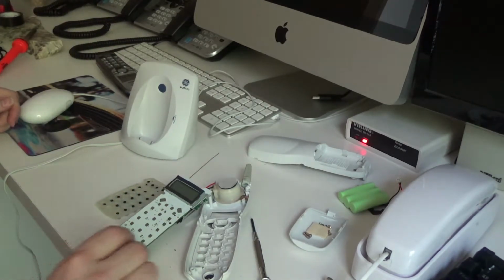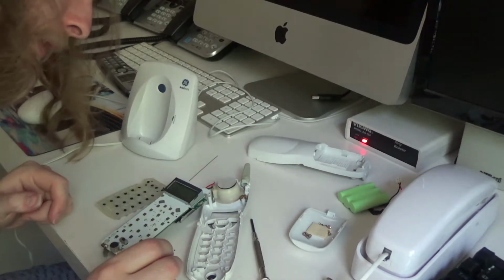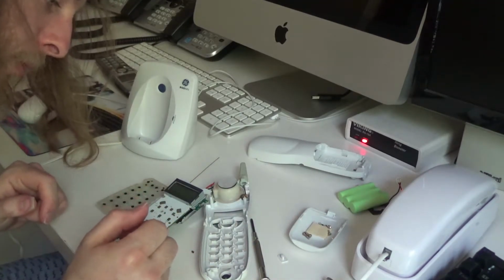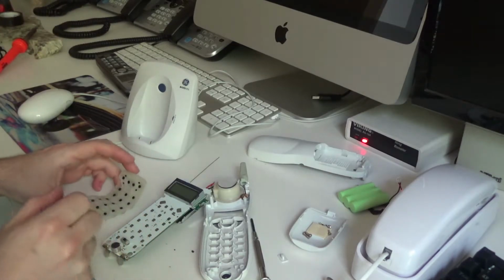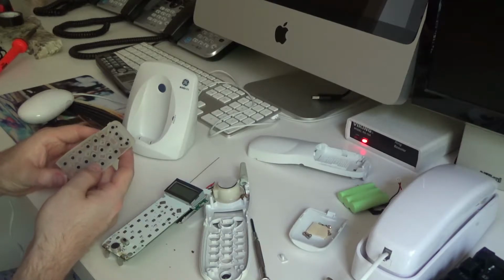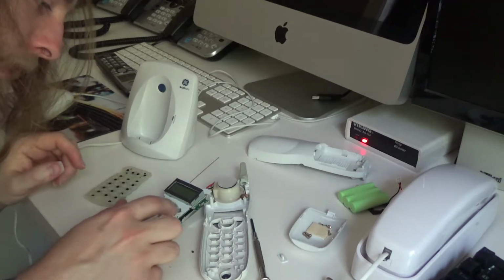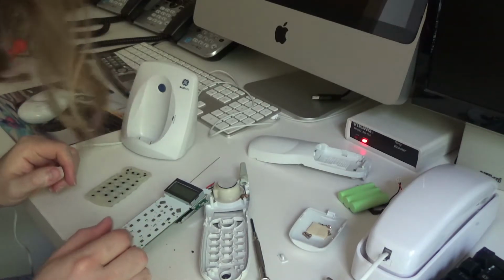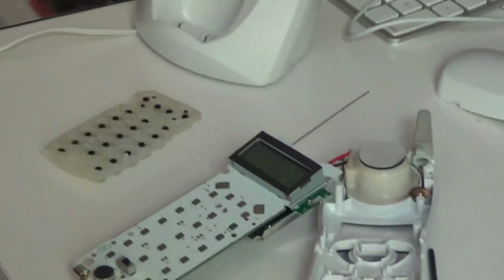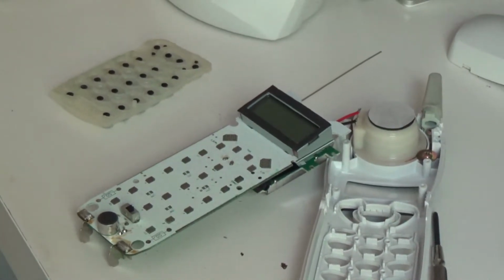No, the ringer switch. So, these actually are relatively decent boards, and they actually have gold-plated contacts, which is quite remarkable, considering that AT&T-made telephones overall have a pretty poor reputation. So, this is not too sticky on the inside, but for whatever reason, I can see on the right side of the board it is a little bit dirty, just that right row. So I'm going to go grab another implement and then we're going to get to cleaning.